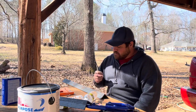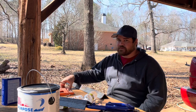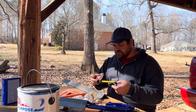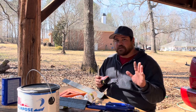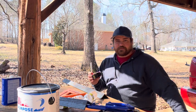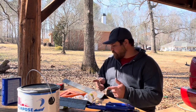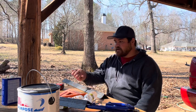Today we're going to build some brackets. We're going to measure them out and make sure they're square because we don't want any wonky lines. I'm going to make them three and a half inches long so that there's only an inch and a quarter on either side, because these are going to go in the bottom of the boards. It's a two by six, and that's wide enough to support the board. I can get as many brackets as I need out of these two pieces.